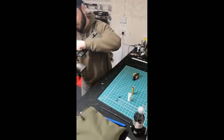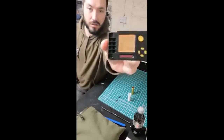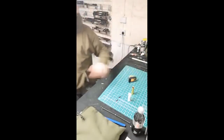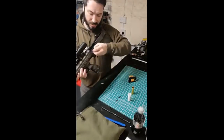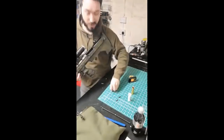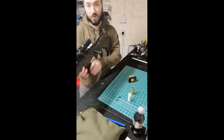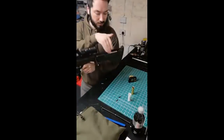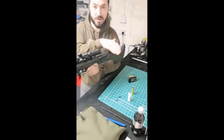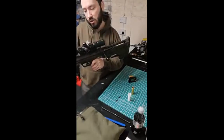So yeah, so far it's very consistent. Bolt pull's very easy. Obviously, everyone's results are going to vary depending on what your setup and stuff is. Obviously, as I said earlier, mine's using the Wasp. For testing, obviously, I've gone for the various weights to test, but normally my Wasp is set to steel sleeve heavyweight at 2.3 joules.